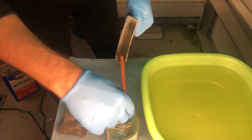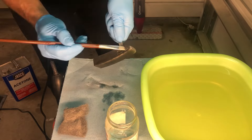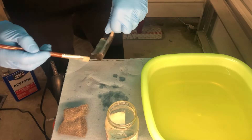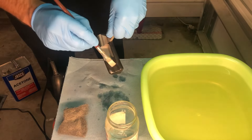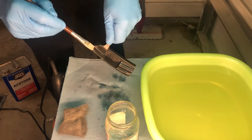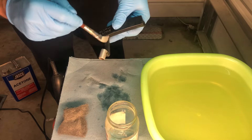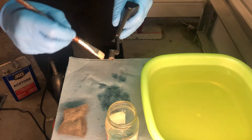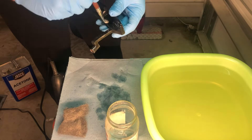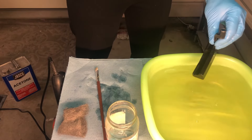So for this next step, you just want to apply the gunmetal liquid and spend about a minute or so doing this. Actually, the shorter amount of time that solution is on the surface the better, because once it hits the cold water it reacts and makes a better-looking finish. The longer the gunmetal liquid sits on the surface, it's actually not doing it any justice. Also, if you leave it on too long, the next coat won't penetrate the surface to make it darker — it'll actually reflect from it. You can do this up to five times, depending on how dark you want the finish to be.